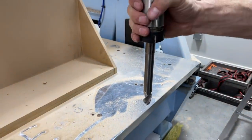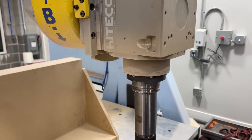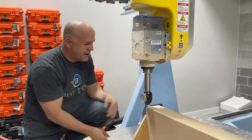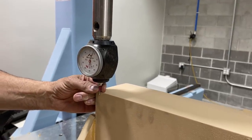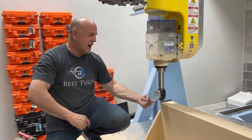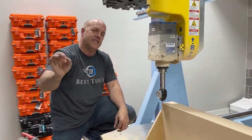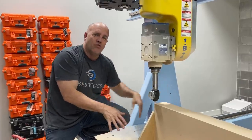This tool that grabs the bit has 20,000 pounds of pull force to pull it up in and lock it, so the tolerance stays perfect while you machine. This tool right here is for aligning so I can set the X and Y point in the computer off a corner and get this part referenced to the machine. This goes in and acts like a bit, a machine head, and you can see as I bend this it moves. I can turn it until this comes around and reaches zero. I check it on this side, this side, and then it also goes up and down, so I can bring it down on top of the part, reference it, get the computer numbers off of it, and zero it out to machine this. We check it here, here, and here, put it in the computer, and reference the part as it's bolted. We're almost ready to hit go.